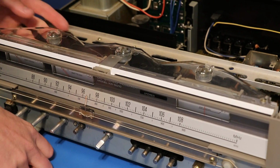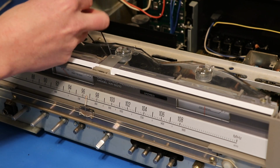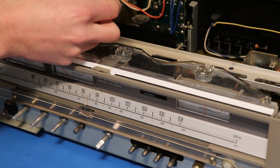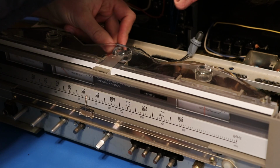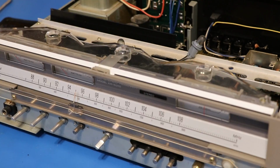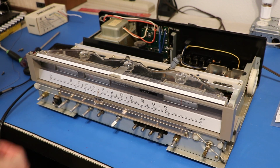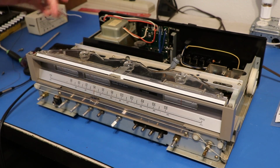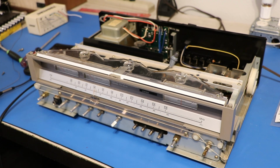Okay, lamps. Let's see how you do the lamps on this thing. Well, this is much better than the MCS. Are these sockets? No, they're not sockets, but they are little boots that we can just run our new light through and then solder leads onto it. Looks like these are tied in with wire nuts. Very classy. It's not too often you see the string done on the outside of the chassis. I actually really like that, because if you were to service this, it'd be really easy. It's just right there, whereas with just about anything else, you're fiddling around inside and it's hard. I dig it. It's about the first thing I dig on this receiver.